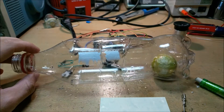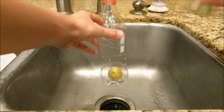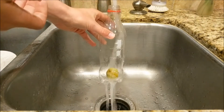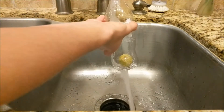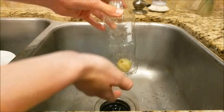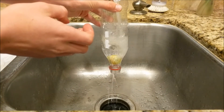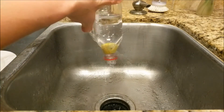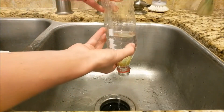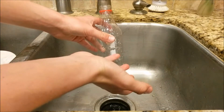This concept can be more clearly understood with my Coca-Cola model diode. Let's put some water through it so you can see. If I have my water diode in this position and put water through it, all the water flows straight out into the bottom — it works as intended. But if I turn the diode around and try to put water through it, almost no water gets through; the diode starts filling up with water. This is like how a normal diode works — it only lets electricity through one way.